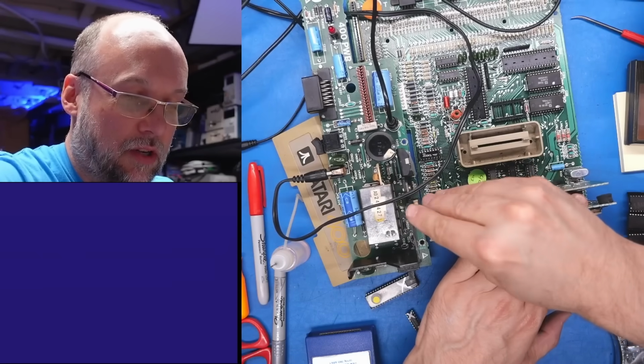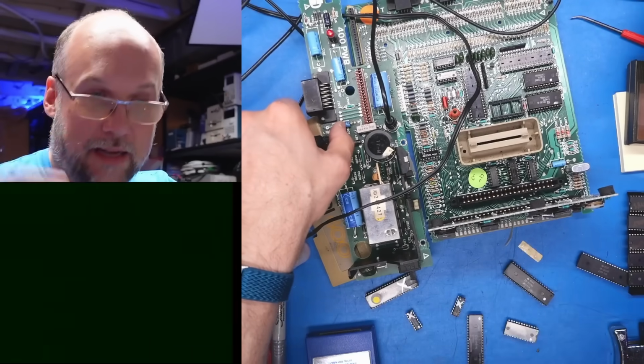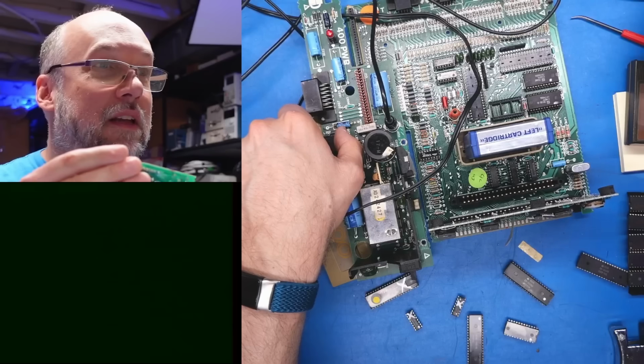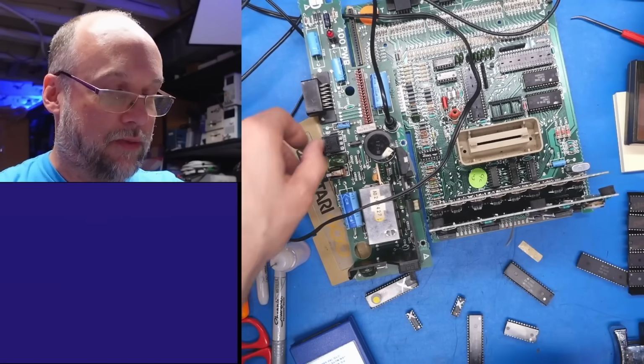Next question, what if the RAM is removed? There's no way it's gonna work now. Black screen. And obviously with the cartridge in, it's going to be exactly the same. It's just not going to work. Yeah, black screen. It needs the RAM for the zero page and the stack or whatever to initialize, at least with these built-in ROM chips.